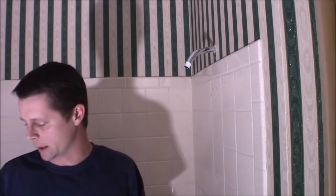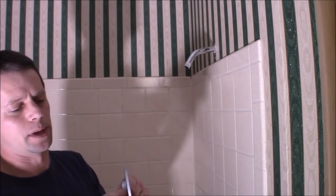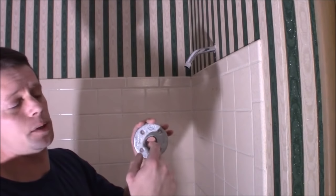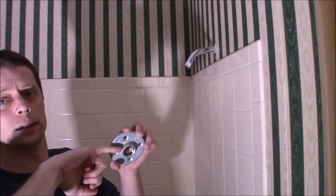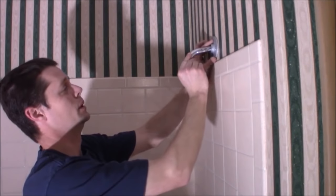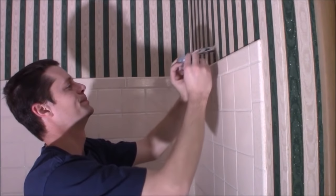So I started thinking of what are some ways I could approach fixing this, and I came up with a few ideas. What I thought would be most ideal is something kind of like this - a cast iron pipe, this one's galvanized coated, basically a black iron pipe flange with four mounting screws, actually threaded for the pipe. Not necessarily this, but something like this - a flange that screws to the wall. What I really hoped for was a set screw coming in the side to fit on that pipe and hold it, but unfortunately I couldn't find anything like that made. This is going to be a bit loose around the pipe, so I thought maybe if I could find something with a set screw, I'd set it to hold it tight and keep that in place.